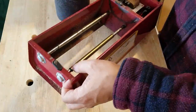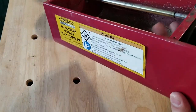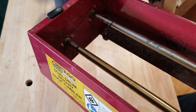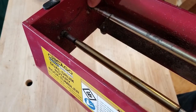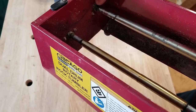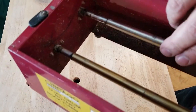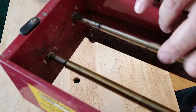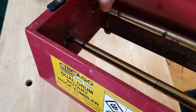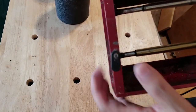The next wear point is the bushings. All the weight of all the rocks runs on these little bushings. Normally these are brass, but these happen to be plastic — little pieces of nylon that these things spin on. You can oil them all you want; they will wear out. Dust gets caught up in there. So these need to be replaced with ball bearings. Cutting ball bearings into sheet metal doesn't sound like fun, so I decided to make my own rock tumbler from scratch.